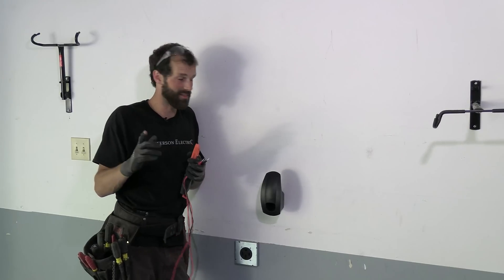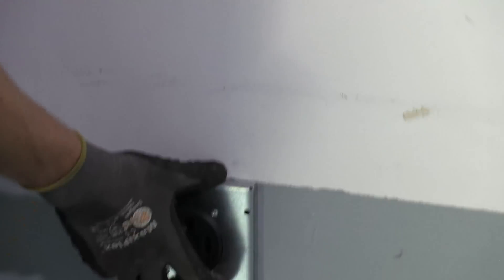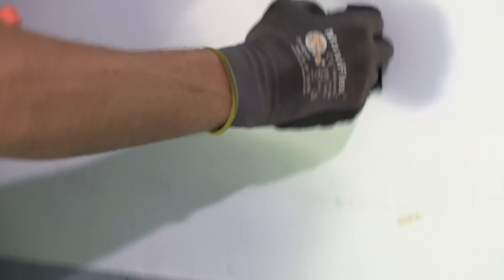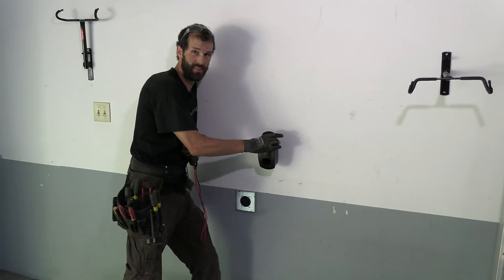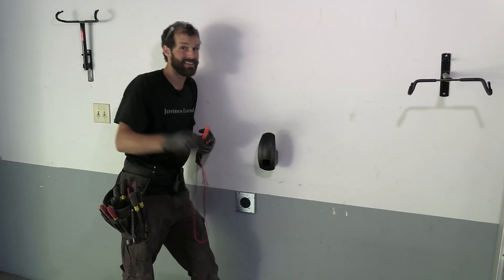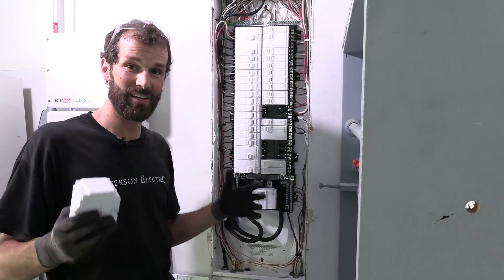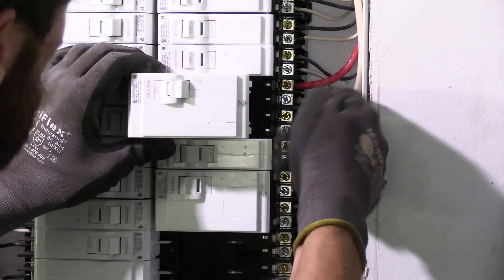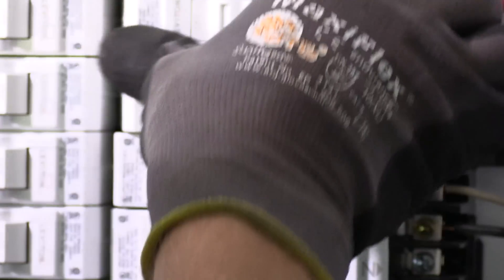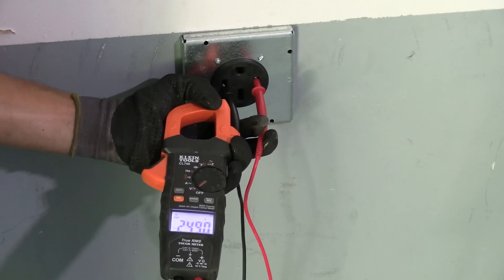We're not done until we check everything. This organizer is great because it has a strain relief built in — when you plug in the receptacle you can let the adapter hang, run the cord through here, and that provides strain relief. If somebody trips over the cord, it pulls on the organizer which is mounted to the stud, not jeopardizing the receptacle and electrical connection. We've got a Leviton smart panel with a 50-amp breaker. Wires are terminated on the side — match the N with the neutral, rock the breaker in, make sure everything's firmly tight, and turn it on. Boom — final electrical check: $249.